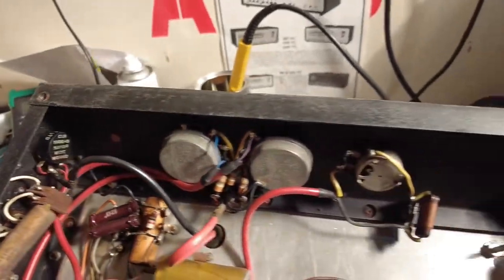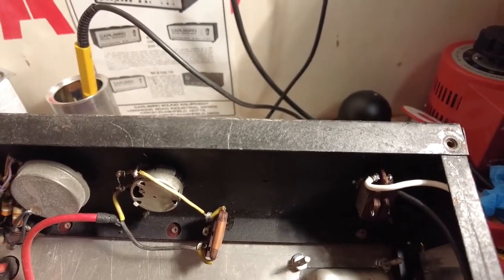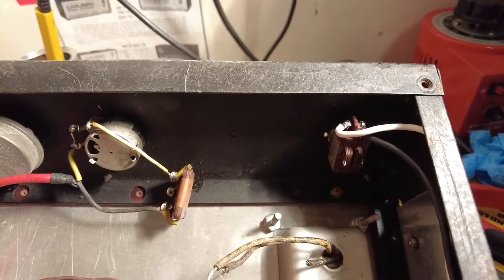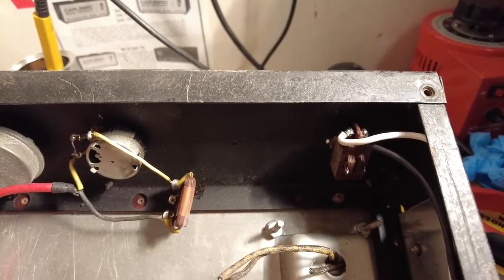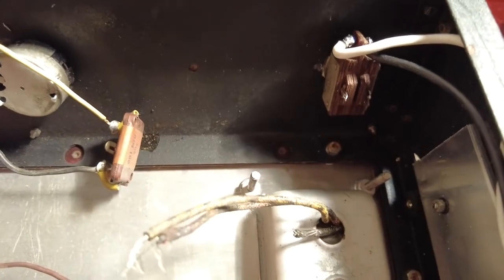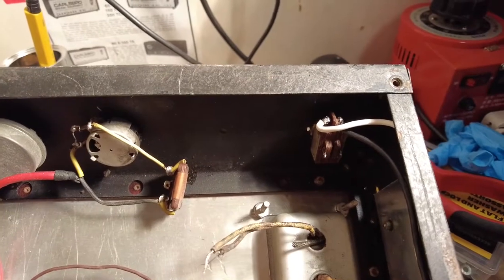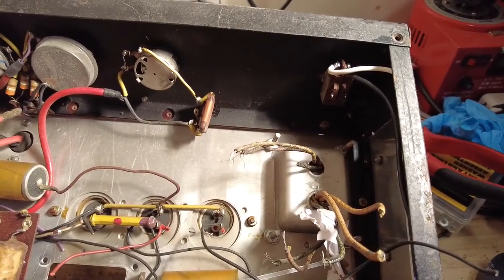And the other thing we need on this amp is a pilot light. I'm not sure how we're going to do that pilot light yet. I may use a 250 volt one, which I do have some of. Or I could use that 5 volt tapping and just tap a pilot light off of that. So there's options there. That's something else I've got to look at, because we do need a pilot light on it. But it's taking shape slowly. We've still got an abundance of wires hanging out of it and things, but most of that we won't need anyway.